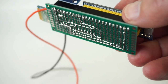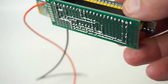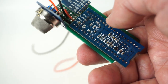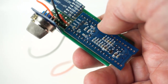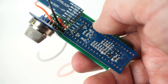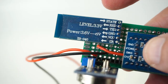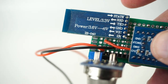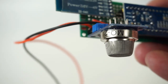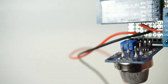This has to be the easiest HS101 circuit shared on the channel to date. It's through hole, not even a resistor, capacitor, or diode. The flash procedure for the STM32F103 is outlined in gadgets number 61. Use the latest HS101 BLT firmware. The procedure to flash the HC-06 is outlined in gadgets number 71. And this is an MQ-2 gas module, which just plugs into the header.